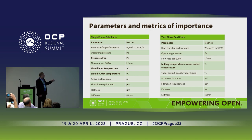Looking at what's in the standard, some parameters and metrics are similar and some differ significantly. For example, in cold plates you have pressure drop — liquid comes in, there's a pressure drop, liquid comes out. There is no pressure drop in evaporators because liquid comes in and vapor comes out. In cold plates, you have liquid temperature coming in and going out. In an evaporator, what matters is the boiling temperature — the temperature at which vapor comes out — and this boiling temperature actually controls the chip case temperature. So controlling boiling temperature is more important than controlling flow. In standard cold plates, flow is very important. Here, flow doesn't make any difference; it's only a pool you have to make sure stays full.